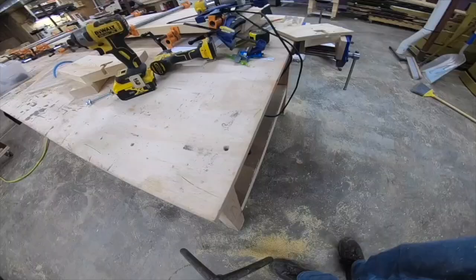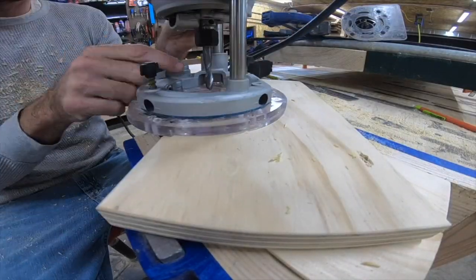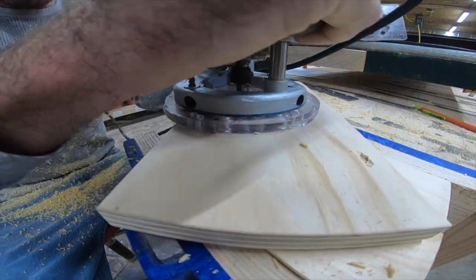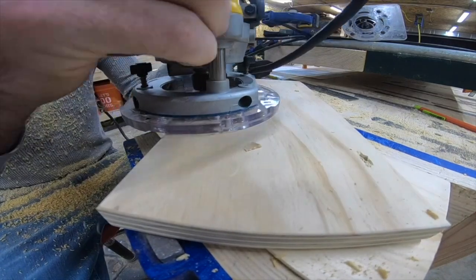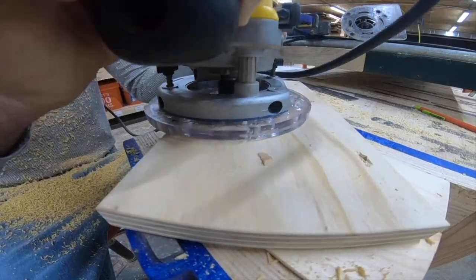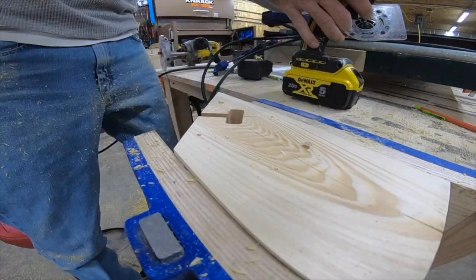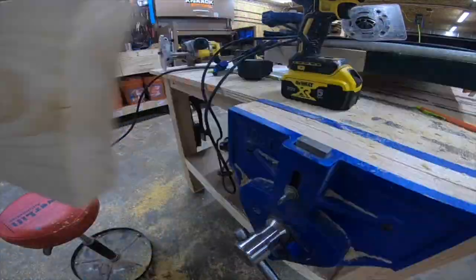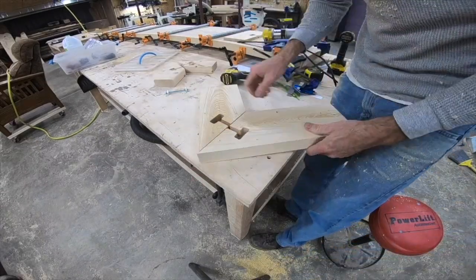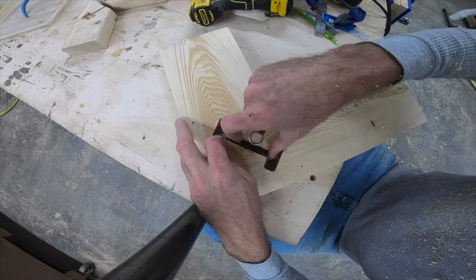It took a little while to find the bit I'm using — it's a long three-eighths up-spiral bit that only came in a three-eighths shank size, so I had to get a three-eighths collet for the router. I'll put links for both in the description. You can also use a quarter-inch up-spiral bit; that's actually what I ended up using on the project I made this jig for — not on this sample piece, but on the bench top I was working on.